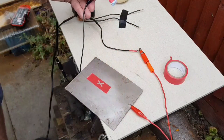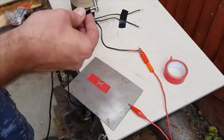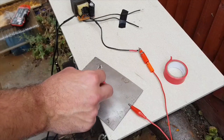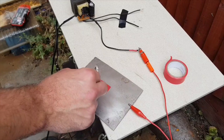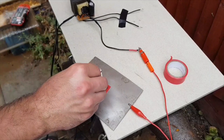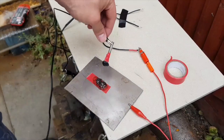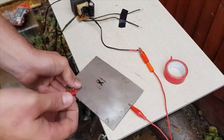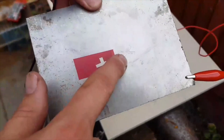The electrolyte I'm using is literally just salty water — as simple as that. I dip the applicator in, make sure it's powered on, and push it to the piece of steel for just a few seconds. You can see I come out with quite a successful etch. I'm actually surprised at how quickly this works. I used to use a little 9-volt battery and you'd be there for about half an hour, but this was literally within about 20 seconds to get a nice little etch.